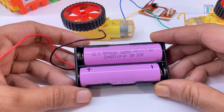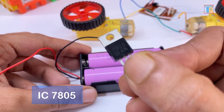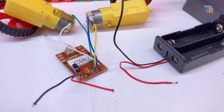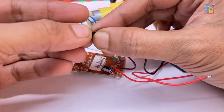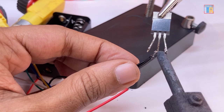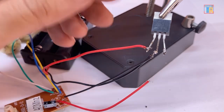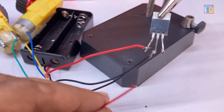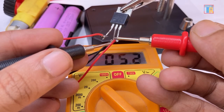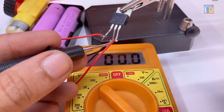To safely power it, I will use two 3.7V batteries in series — 7.4V total — with a 7805 voltage regulator IC to step down the voltage to 5V. Connect the battery's negative wire and the receiver's black wire together, then connect both black wires to the middle pin of the 7805 IC. Connect the battery's positive to the first pin of the IC and the receiver's positive to the third pin. This will regulate the battery voltage to a fixed 5V, preventing the circuit from burning out.